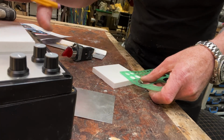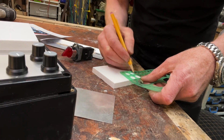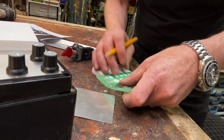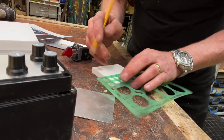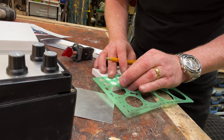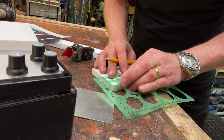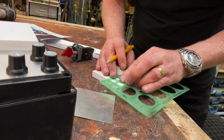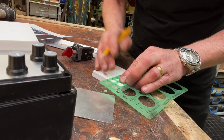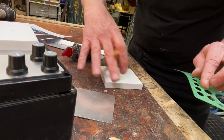I'm giving a 5/8 inch radius to the base piece and a half inch radius to the piece on top of it. If I gave them both the same radius, I think you'd notice that they didn't quite step. And if I screwed up, Sintra is inexpensive.